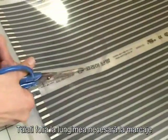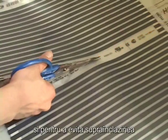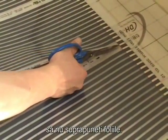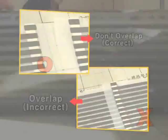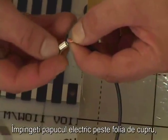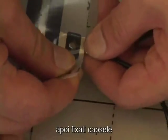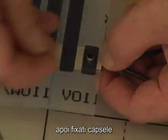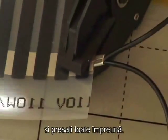Leave 10 to 20 centimeters of space between the wall and the insulation pad. Place the hot film to cover the insulation using OPP tape and electrical tape, then fixate the insulation pad. When mending hot film, cut into the film where there are no carbon heating materials, and to prevent overheating, do not place the film on top of each other. With a puncher, put a hole into the copper coil of hot film. Push the wire connection terminals towards the silver plate and copper coil, then connect it to the eyelet terminal. With pressure, the equipment fixates onto the hot film.